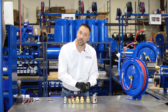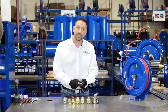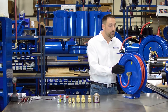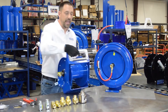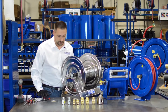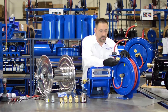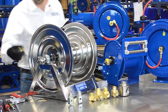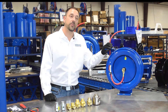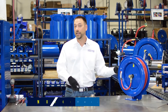This shows the range we offer — various materials, various sizes — but the function is all the same and servicing them is all the same. The causes that could be making you change your seals is also all the same. You find this type on most of the spring rewinds and also on many hand cranks such as this 100 series Challenger or this 1125 model. The only difference is in the way they're installed — on spring rewind reels they're installed with a stud, and on these they're installed by one of the ports. Before we get to servicing the swivel, let's talk about the main causes of failure so we can actually solve the problem and not have the same thing happen again.